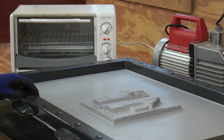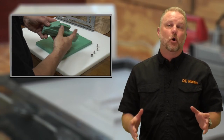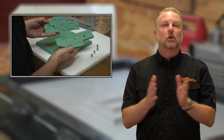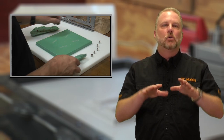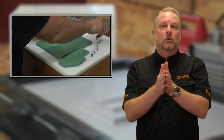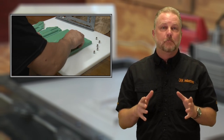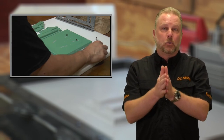Just allow it to cool. We're using a Master Series mold made by OnTarget Multi Molds. These molds are unique in that it comes in a butterfly split. This butterfly split is magnetized so that not only can you use it as a split mold, but you can also put it together and use it for book forming if you prefer, or you can use it for putting together so that after you vacuum form, you can then fold your kydex around the prop.